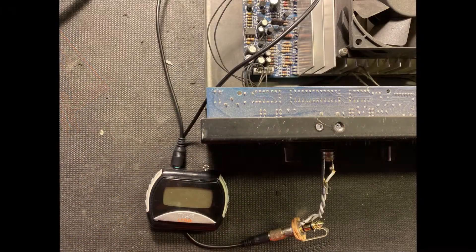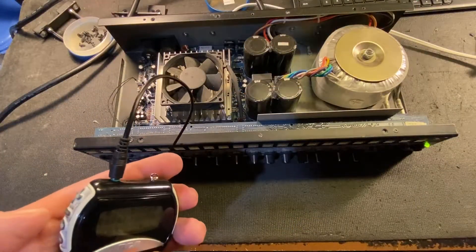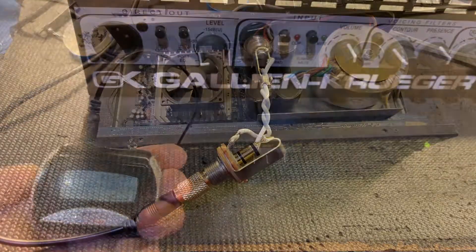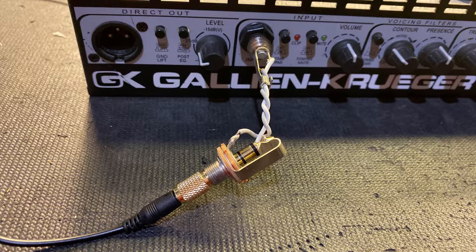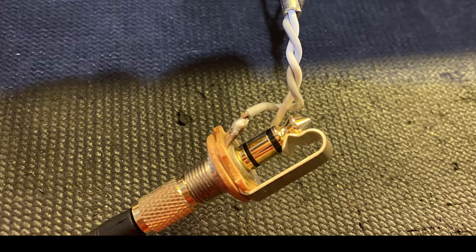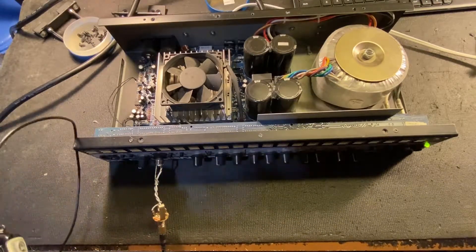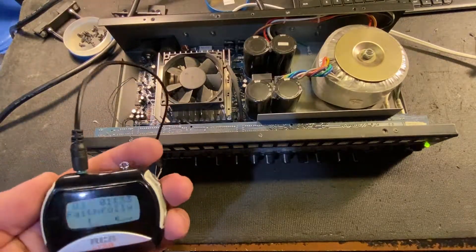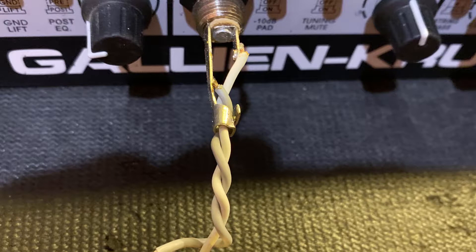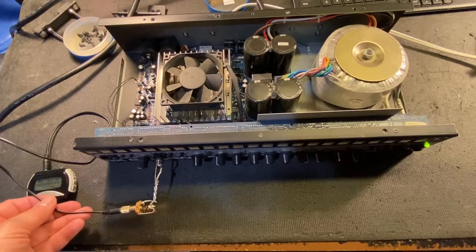Here's another version — a good idea if you don't want to cut your 1/8 inch cable. I needed a quick and dirty adapter one day, so I threw this version together out of parts from the junk bin. I added a 1/8 inch to 1/4 inch stereo headphone adapter to my cable, then soldered a 1/4 inch mono jack to a 1/4 inch mono plug. When you plug the headphone adapter into this jack, it leaves the ring disconnected, which means we're safe. Shielded wire would have been a better choice here, but this was a quick solution and it worked fine for testing. If you don't have any shielded wire, twist the wires together tightly — this will provide some noise reduction. Also, tape up or heat shrink any exposed connections.